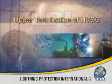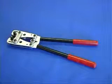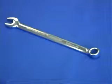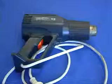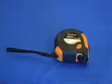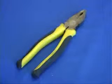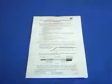The upper termination of high voltage shielded cable. The tools and parts required for the HVSC upper termination include a compression or mechanical crimping tool to suit a 50 millimeter crimp lug, a sharp knife, a Phillips head screwdriver, a shifting spanner or 14 millimeter spanner, two screwdrivers for use as friction cutting tool handles, a heat gun or gas torch, a tape measure, a marker or pen, combination pliers or cutters, and the terminal base assembly supplied with the terminal.